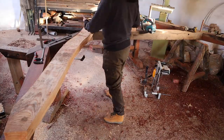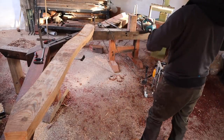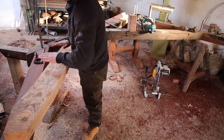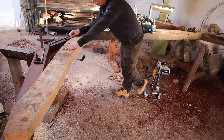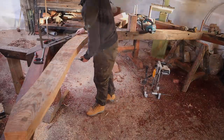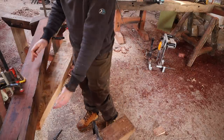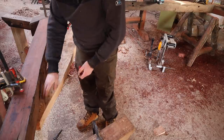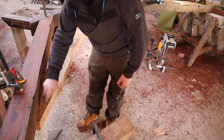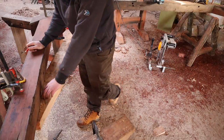Because this frame is currently facing me — it's going to stand up and face the front — if I mark this shoulder now from the top, it would be the wrong way around, since I'm only having a shoulder on one side of the tenon. So I need to mark it from underneath. Now that it's clamped from underneath, this is the side the shoulder will sit on. I can take this mark — that creates our shoulder — just a really tight line there, and we'll cut the shoulder on the back of the pencil line.